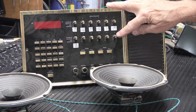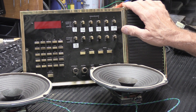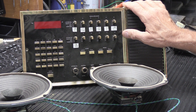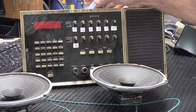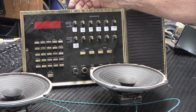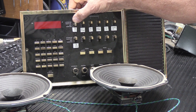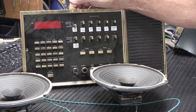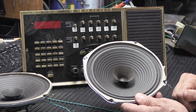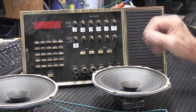Up here we have 12 room control switches. The N80 has two 25-watt amplifiers and is designed to handle up to 20 speakers — that's 10 pairs. Each switch has four positions: the top position is intercom only with no radio; the next down is radio and intercom; the third is off — no radio, no intercom, and no door chime; and the last position is monitor, which works like a baby monitor, broadcasting that room's audio through all other speakers throughout the house.